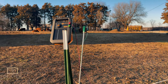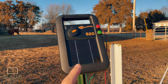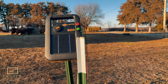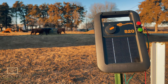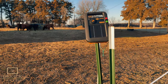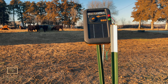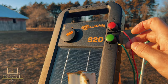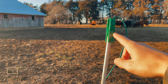So this first item is going to be some general electric fencing supplies. I use one of these solar-powered chargers — the 'S20' on there signifies that it will supposedly go a 20-mile distance as long as no grass or anything is up on the fence line. That would be a little bit overpowered for the size of my farm, but it's better to be overpowered a little bit than underpowered. The solar ones are more movable than ones that you have to plug in, and that's the reason I decided to go with that. The way these work is you've got a power side and a ground side — the power side attaches to your line and the ground side goes to a rod stuck in the ground.